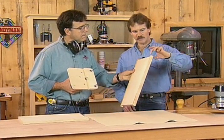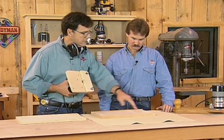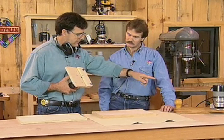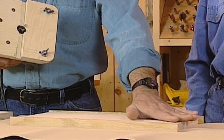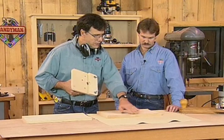I won't have to search — I can literally do this sort of operation in my sleep. But would you be restricted if you had the edge banding on all four sides? What would you do when you get to a corner? I would have to do the opposite sides before placing the edge banding on the adjoining edge, so I'm limited and can't get into a corner. But when I do the edge banding across the end grain, I'm not as much in danger as you are with that other jig, where you're sweeping the bit out over the veneered area. With this fixture, I very carefully control how much of the bit can be exposed to the veneer, so the original sanding job on the veneer is never tampered with.